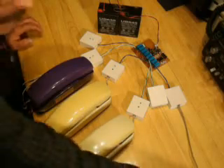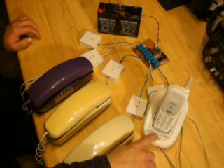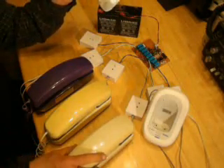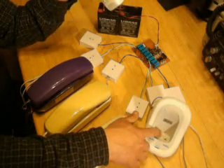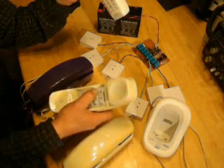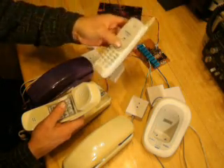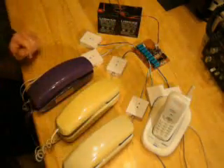To go a step further, I took a cheap cordless phone that I picked up and modified it. Most of these phones have the handset find button, or page button. I wired this up with a relay inside the handset so that when the reverse polarity comes across the line, it triggers this button. So I can pick up the phone, hit four, and now this thing beeps — so I would know somebody was calling me. I just hit talk, answer it, and now I'm talking. That's my little project.